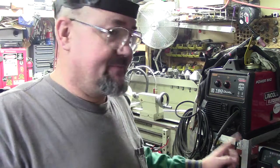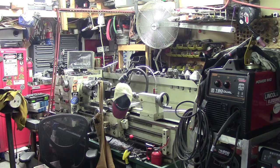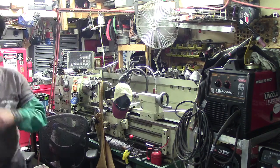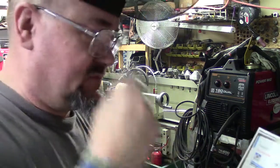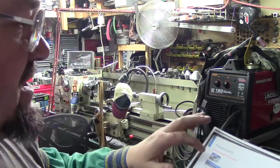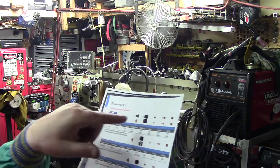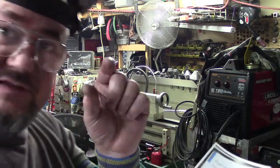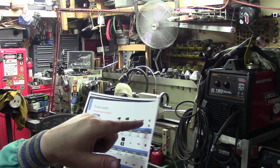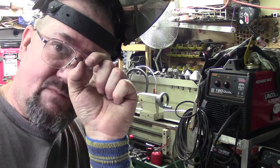Plasma cutter, I love it. As a matter of fact, I had them print out a colored sheet when I got this. So when you guys get your expendables — you have dry cutting, then you have your mechanized. The guy I got it from had a mechanized torch, but I'm using the dry cutting drag tip. Now what's unique is if you want to do fine cutting, you actually order the consumables for the PowerMax 30 — it narrows the cutting stream down.